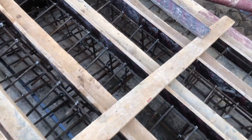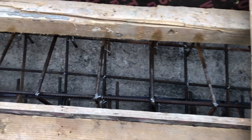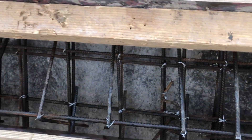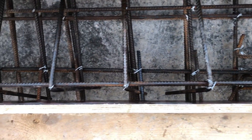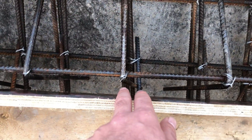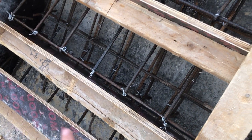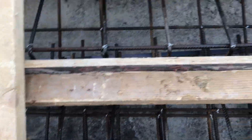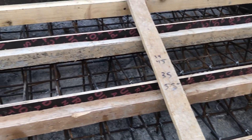Now let me go down. In all this area they haven't prepared it yet — they haven't provided the steel bar concrete covers. You can see the space is more in some areas, and in some areas the steel is touching the formwork, which is not acceptable. They also have to clean this area — without cleaning they cannot cast the concrete.